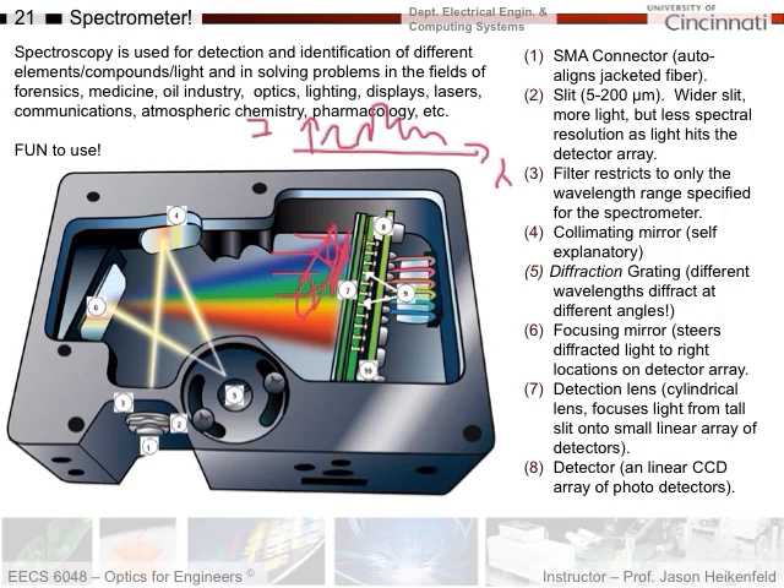If the photodiodes light up, it tells me the blue light is strong, green on out through red, and you can read this out to figure out which parts of the spectrum have which intensities. Remember the slit — if you make it really wide, the green and yellow start to blur together and the colors start to blend because they're less tightly defined. A small slit gives better resolution because the colors don't overlap spatially. But a small slit means less light in, so there's a trade-off between spectral resolution and being able to detect the light.